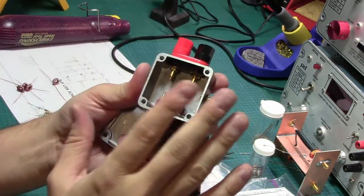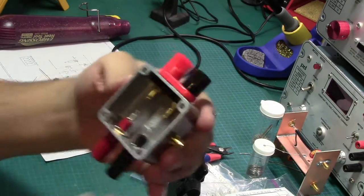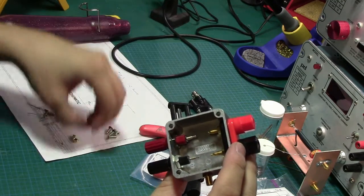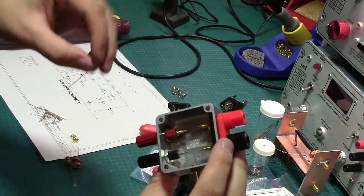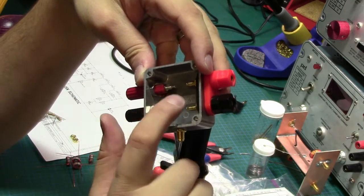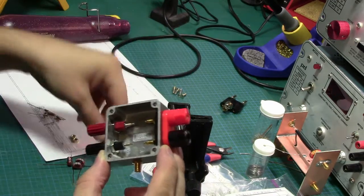So with the top covered here, this should prevent any sort of EMI from entering the device, so we're only measuring the conducted EMI. I'm not entirely sure that's necessary or required, but I'm going to do it, so that's the way it's going to be. The pathway for the actual DC goes through 4 coils, so these 4 inductors that I have. It's going to take a little bit of ingenuity to squish them all in there. I'm thinking I'll put them all in a line, tuk tuk tuk tuk like this. So I'll have to see how that's going to work.